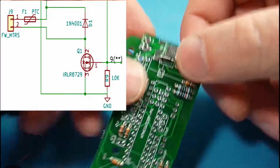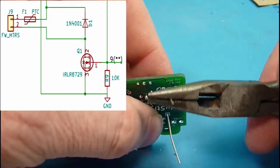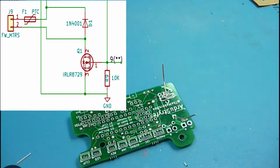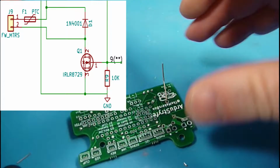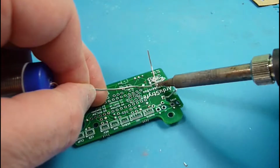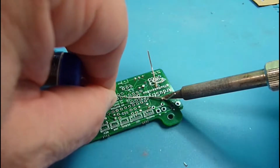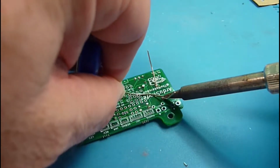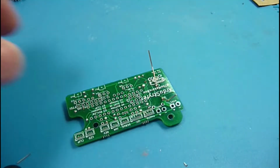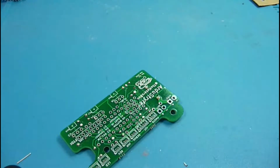When your motor or a solenoid is de-energized, the collapsing magnetic field will generate a spike in voltage, and that can damage the MOSFET that we're using to control it. So we're basically giving it an off ramp to shunt that current around our MOSFET and keep it safe. Diodes have a lot of different functions, but controlling the flow of electricity is one of the main important ones.